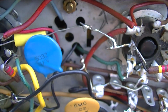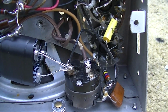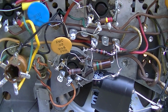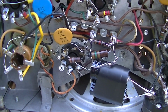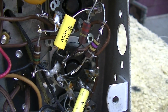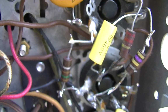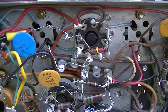The other thing I would mention, and I'm not criticizing at all, I'm just trying to put this out there, because when it comes to electronics, young people don't really have anybody anymore to mentor them or teach them like we did. At least when I was in high school, I was about the last year of electronics. But when you solder a component in, don't just lay it next to what you're trying to solder it onto and blob solder onto it like that right there. Create a mechanical connection. J-hook or wrap the wires together so that they're mechanically connected.